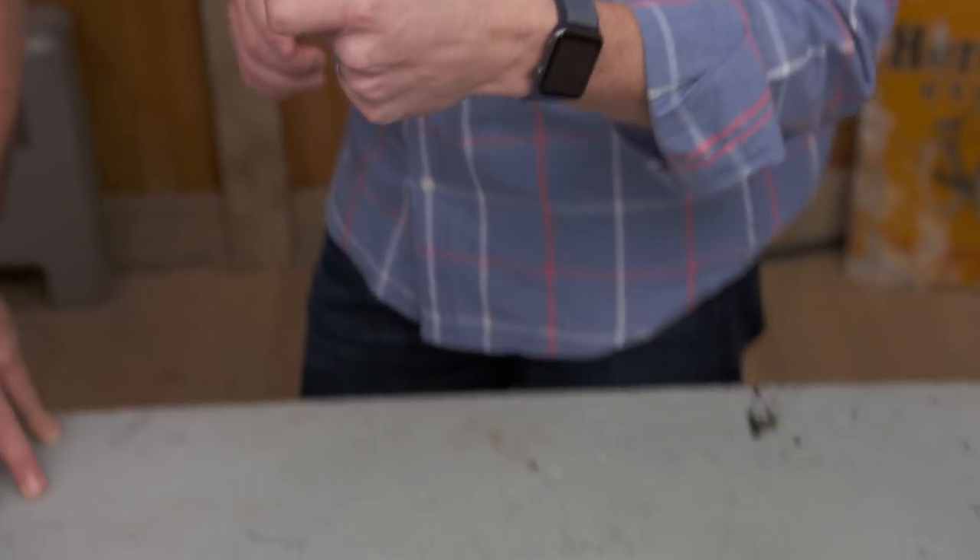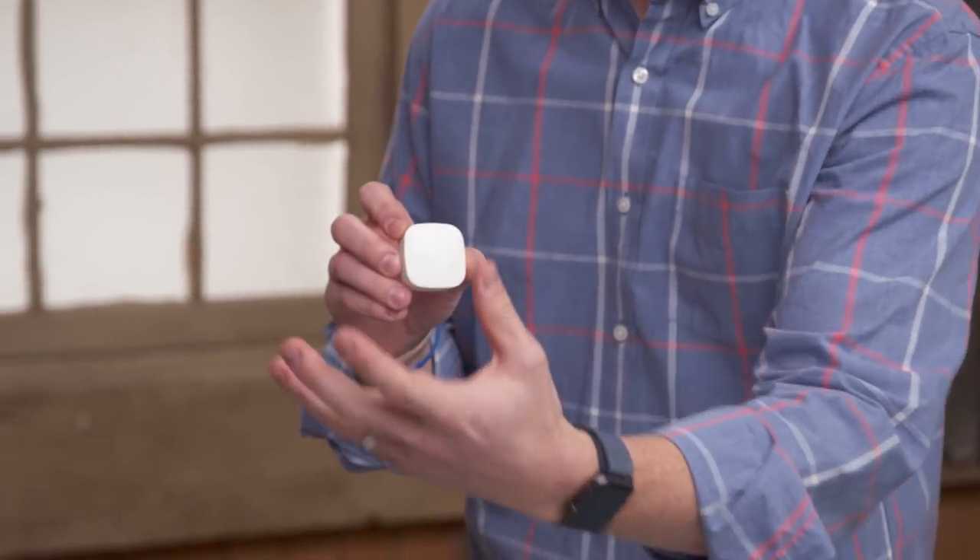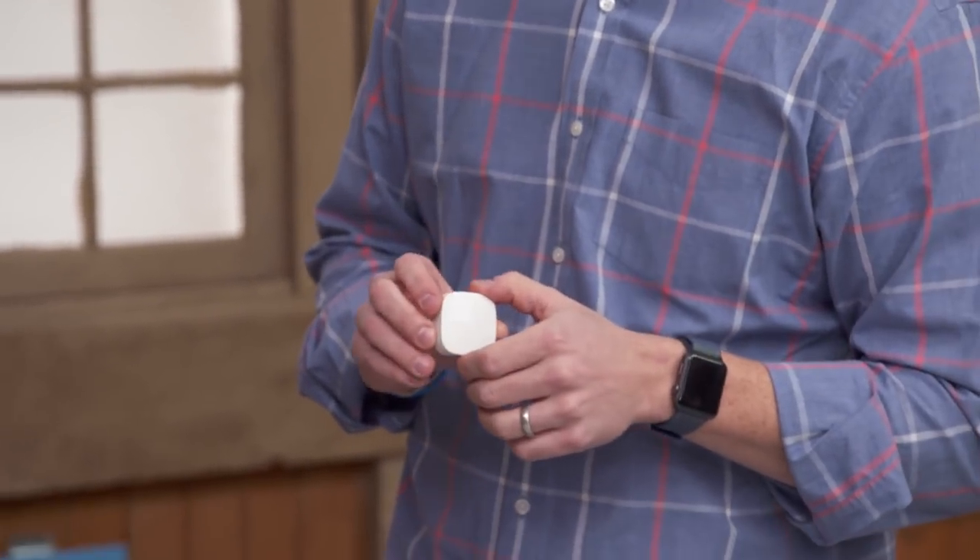And now there are wireless sensors that can be strategically located around your house — they even have motion, so they sense only the rooms you're actually in. But you can't have a conversation about saving energy without telling people: if you've got a system that's been in there for 50 years, it's probably only 50–60% efficient. You could do a lot better — change it. Local utilities are often your partners with rebates, and the monthly payment for new equipment is often less than what you save in operating costs.